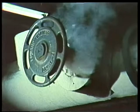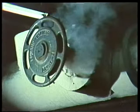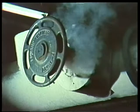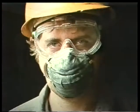Now, there may be some thermal insulation to remove before you can work on the valve. Unless you know otherwise, it's best to assume that it's made of asbestos. Be sure to take the proper safety precautions. Wear the required safety equipment while removing the thermal insulation. You can probably remove any insulation while waiting for the work release.